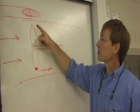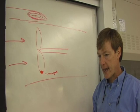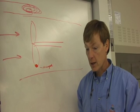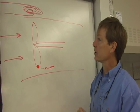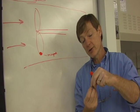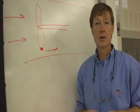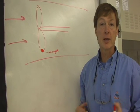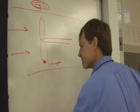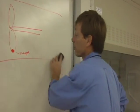Turbine flow meters: this needle is powered simply by the motion of the turbine. This works on anemometers too — the cupped anemometers that spin around on a weather station. If you pull open the anemometer, there's a little magnet on one side and a coil of wire. As it sweeps through that coil of wire, it produces a current, which powers the meter that reads the wind speed. See also other methods of determining speed: transducers, differential pressure cells.